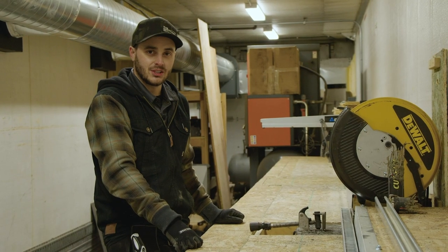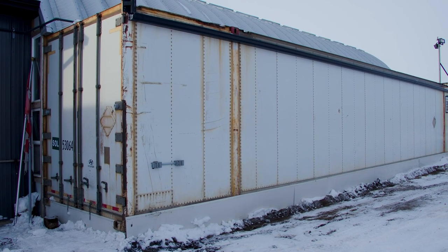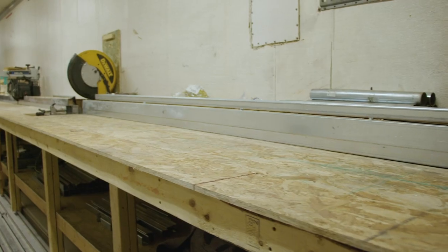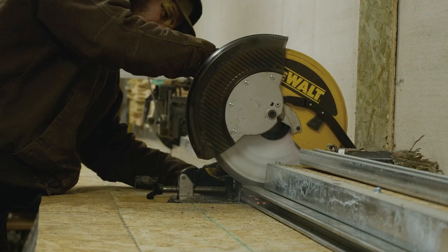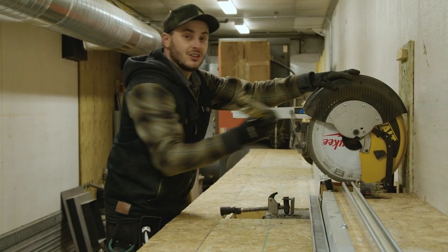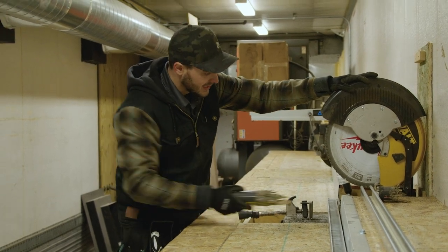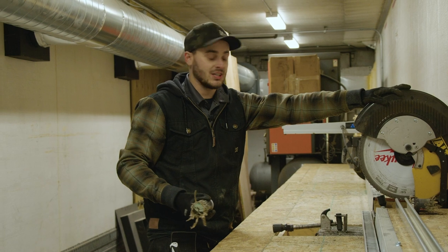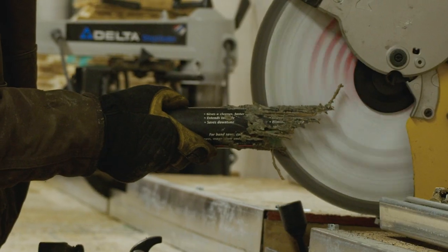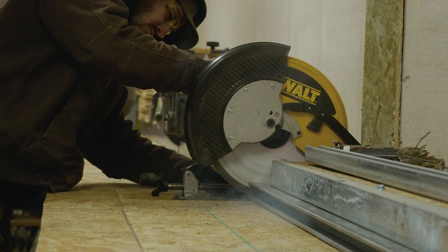We're going to cut up all the strut for this job. We actually have an insulated 53-foot container in our yard, and we converted this to our cutting station. We built a table where we can cut our strut, and we have our metal cutting chop saw here and our lube, which is super important. These blades are super expensive when cutting this strut channel, but it does a very quick and easy job of it. Make sure you're lubing your blade if you're cutting with this. We'll cut these struts and then get back to the job.